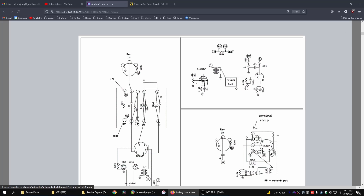Then we have this 220K resistor, which allows a little bit of the signal to stabilize and provides grid leak for the next 12AX7. There's also a 500 picofarad capacitor — in my build I ended up removing that because it was making the reverb a little darker than I wanted. I wanted that springy, high-end zingy, almost surfy type feel. With the 500pF cap it was more of a roomy type reverb and didn't have that same sibilance or sizzle from the spring. You could experiment with a smaller value like 250 or 100 picofarads to dial in the tone of the reverb.